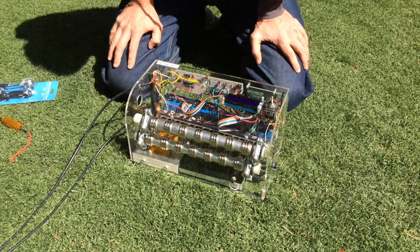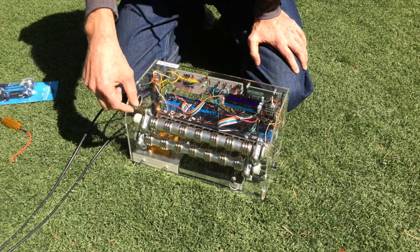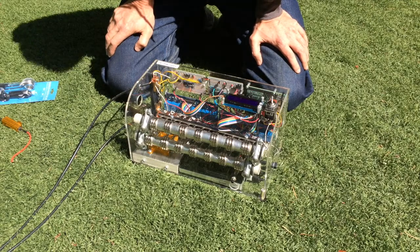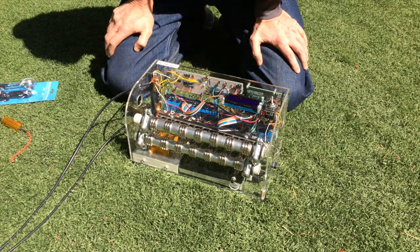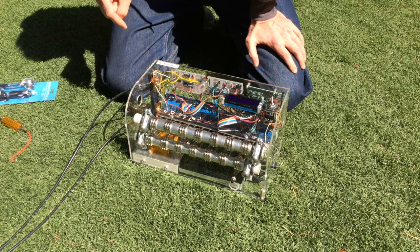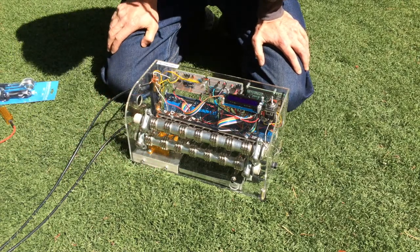The other component of the load chain is heat sinks. For the coils, they sit around this aluminum bar, which actually needs a little bit of aluminum foil over it to get the diameter large enough to be a tight fit. It's important that the bars are aluminum and nothing with iron in it like steel, because that would increase the inductance of the loads — and inductance is our enemy as far as switching and causing arcs, since this is DC power. The power resistors are on a more standard aluminum heat sink.